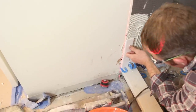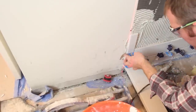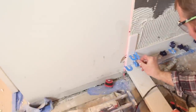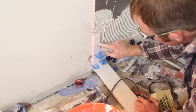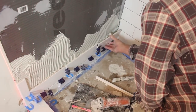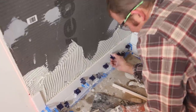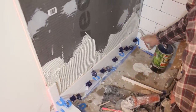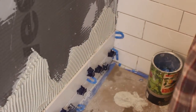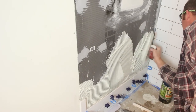The other tool that comes in handy is a laser level — we're using a Bosch laser level. You always want to scrape the thinset mortar out when it oozes between the bullnose and the drywall — you don't want to leave any thinset residue on the drywall. Here's our last tile of the second row, and Steve is going to use his carpet knife to create a gap there. You always want to leave a little bit of a gap in the corner for expansion and contraction — we're going to fill that in with silicone later on.